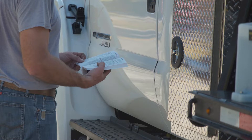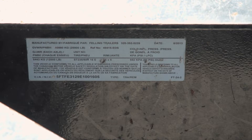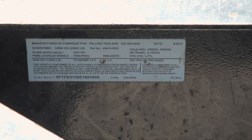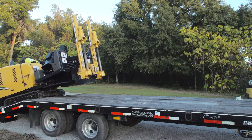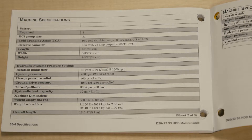Before transporting the machine on a truck or trailer, read the truck or trailer manual for safety precautions and information. Properly attach the trailer to the towing vehicle and chock wheels or set the park brake. Ensure the drill's gross weight is within the trailer's and towing vehicle's gross weight limits. Load and unload the drill with the trailer on a level surface and attached to a towing vehicle. See the machine's maintenance manual for drill size and weight specifications.